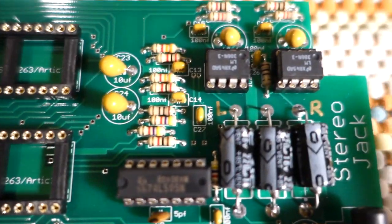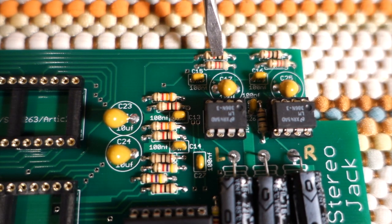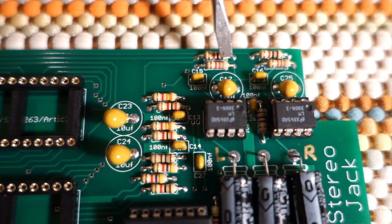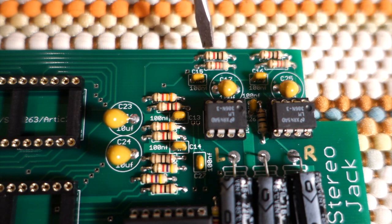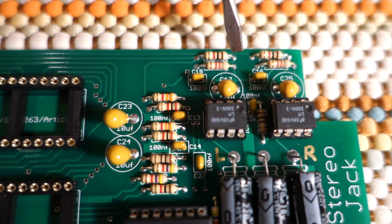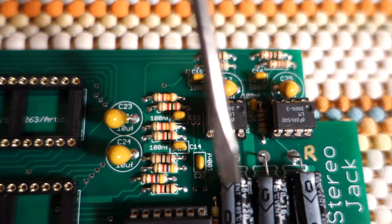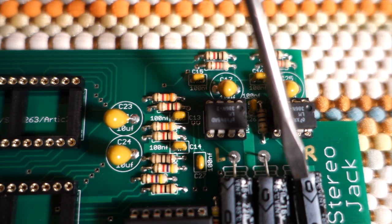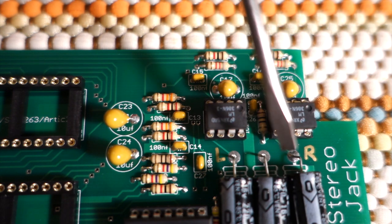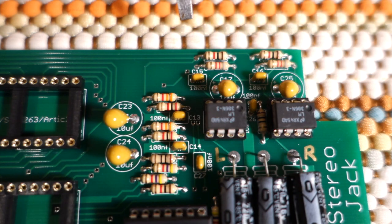That's also fixable. To do that, we're going to look over in the other corner of the board. Right up here above the two chips, there are two sets of resistors, and these go from the left and right channels. What we're going to do is remove these resistors — this one here and this one — and just wire them up opposite, so the input from this one is going to go to the output of the other one. That'll effectively flip the resistors before they get to the rest of the circuitry. We want to do it here because this is before it actually gets amped — there's a little mini amplifier here — so we want to reverse the channels before the amplifier stage.